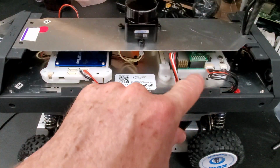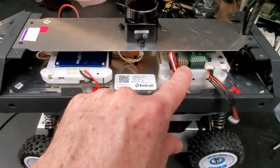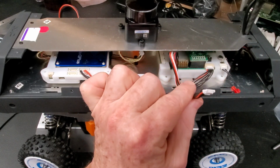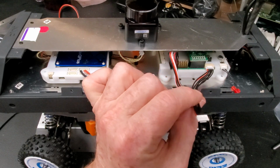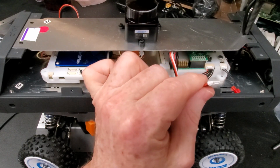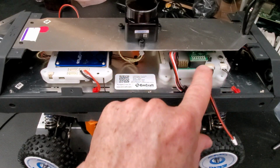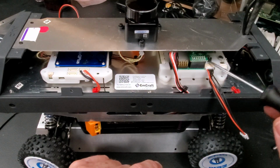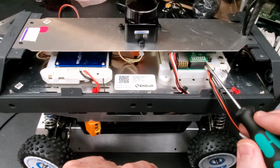This is the debugging connector here. So on the CanHub K344, this cable is called DCD-LZ for drone code debug, and it includes both serial wire debug and UART on this connector, and that'll plug into one of our debug adapters to make it easy. You might be able to just barely see it way up in there, kind of underneath here. There's a regular JTAG as well.